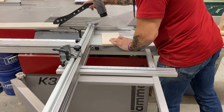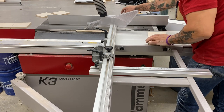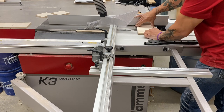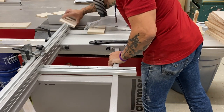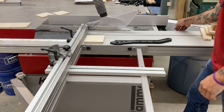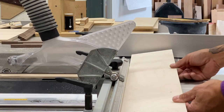I just repeatedly feed the board into the saw making each repetitive cut, and then finally push the last few pieces through safely with a push stick. To me there's a little bit of play with the push stick — another connection — but I feel safe pushing that piece through. It's probably about five inches wide, plenty far enough from the blade. A good grip and nothing's going to happen — ultimately you have to make that call. If you're not comfortable doing it, don't do it.